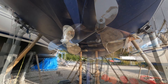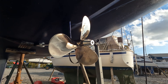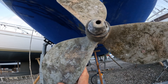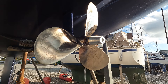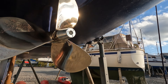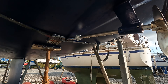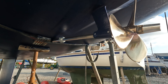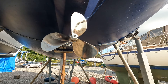This shiny prop was the result of a couple of hours of sanding at various grits followed by some metal polishing. Oh man, it looks so good — what a difference to what it used to be. I gave it a proper good sanding and polishing: 120 grit, then 240 to get out the deepest scratches, then 600 grit, 1200 grit, and then polishing. It's not perfect, but it's still damn shiny — a heck of a lot better than it was. I fitted the anode on the end and the other anode on the prop shaft. That's it for anodes on our boat — same as we had before, so I'm going to stick with it because it seems to be working.